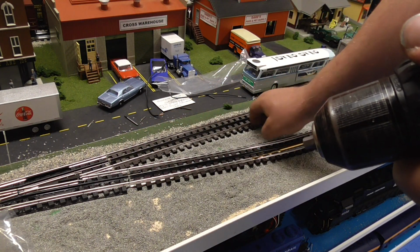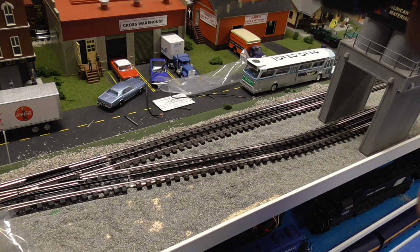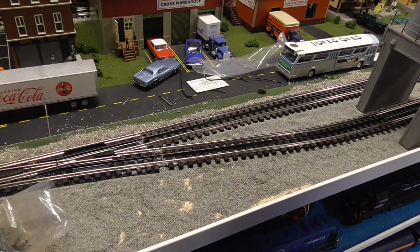I don't use old school transformers for anything newer, and I actually don't recommend it. And I'll tell you why here in a minute. I'm sure people will disagree with me. But, so yeah, anything Lionel TMCC, Lionel Legacy, or MTH DCS, you should be using newer electronic transformers. Only because the old school transformers like the Lionel TW or the post-war ZW, they're not clean power. Their power puts out spikes, which can be harmful to modern locomotives.